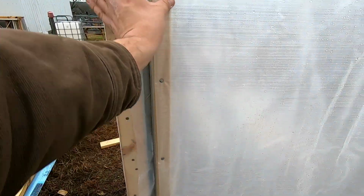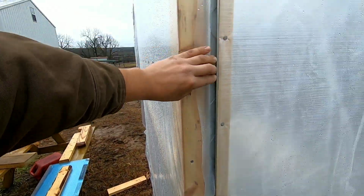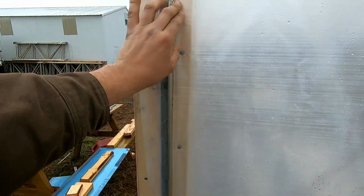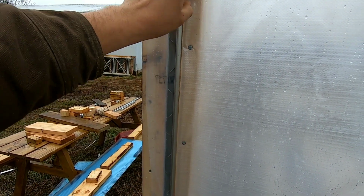Before you get started on the curtains, when you build a frame, you have to make sure you have enough room for the pocket, wood wise. As you can see here, we put a 2x6 right here, and then the hip board and the baseboard. The reason for the 2x6 is, first of all, for the C-channel that's coming down, and then you have enough room, an inch and a half here, to be able to catch the pocket in. So before I get ahead of myself, I'm going to show you the exact steps that I took.